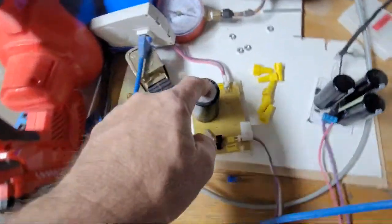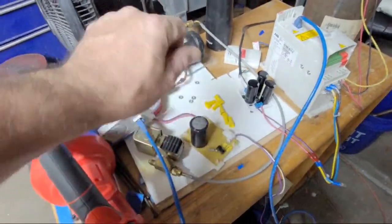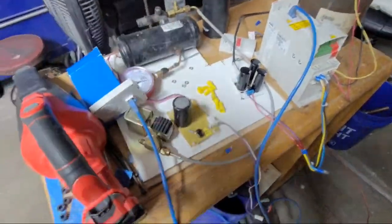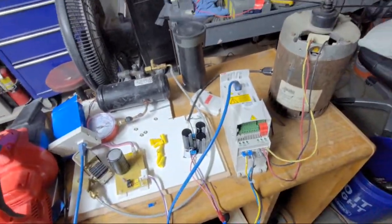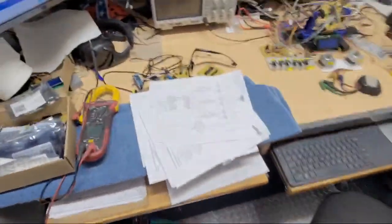So that's a 230 volt one that I've also ran with this, and it pretty much gets really fast before it clips out from voltage sag. So it could move quite a bit of air actually. And if I just built this a little bigger, it'd be fine. If I get my hands on one of those 460 volt motors, I might try it with this thing and see what it's capable of. But I definitely think that axial fan is moving faster than a 1700 RPM motor. It's pretty sketchy.